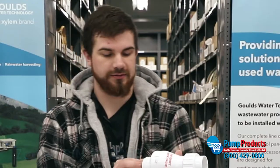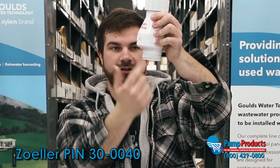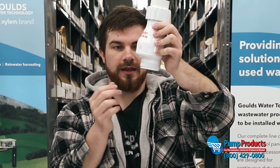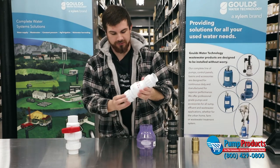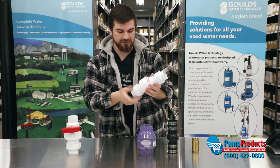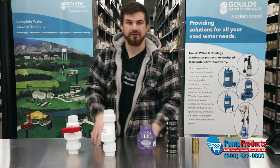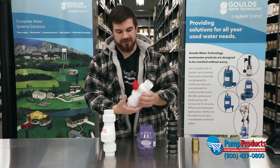This is a variation of the flapper style called a quiet check. There's a small spring inside under half a pound of pressure, so once it opens it closes silently. It's really good for home applications where you might hear the pump running at night — say a sump pump — making it ideal for that use.